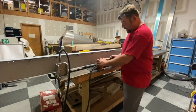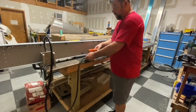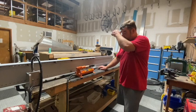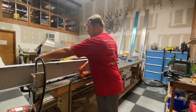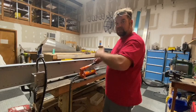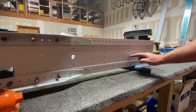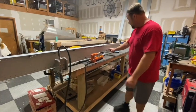Squeezing force comes from a little hydraulic cylinder and this port-a-power unit. It has a valve here that just releases and closes it, and then a pump. In general, you're going to set all the cap rivets — the top and bottom rows — with five pumps; that means five full strokes. The center row, when you move up to it, you're going to do six pumps. The outer cap rows will be five pumps. So it's five pumps on the caps and six for the very center row.